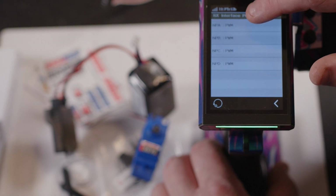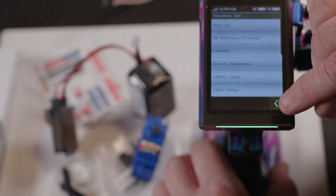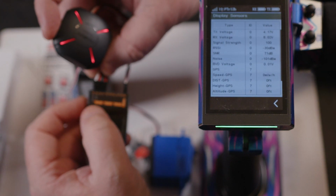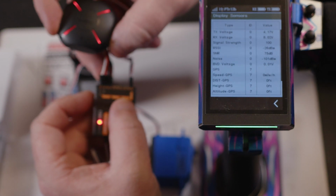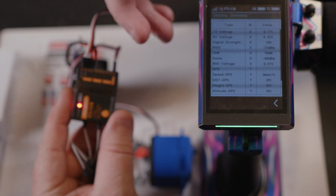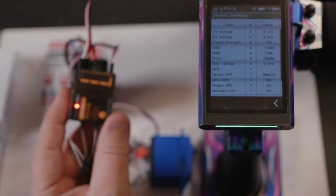Let's have a look, see if I can remember where these are. So if we wanted to change one of the external sensors to be iBus 2, it should be that one. Yep. Just trying to look which way around the ports are labelled on here. So we've got A, B, C, and then 9 is D. But it does mean you've got 8 ports that you can use on the NB4 for channels. Then you've got a separate one you could use as power out, and then you've got 4 extra ones that you can use for iBus 2.